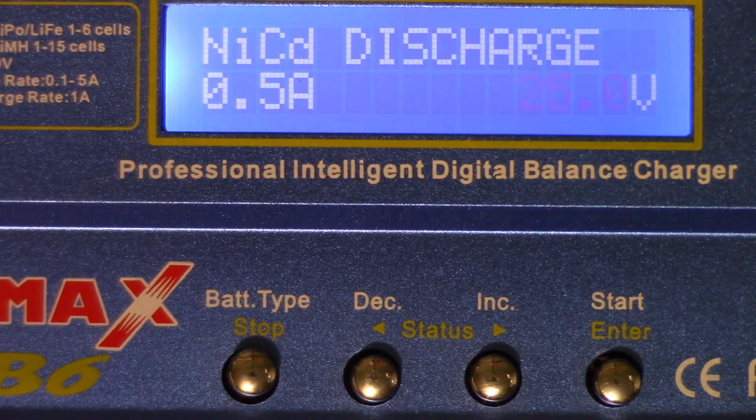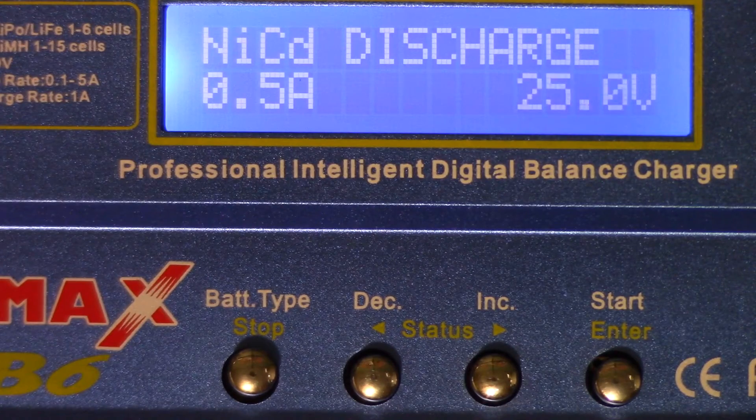I can't stress this carefully enough: make sure you follow the specified discharge and charge levels for whatever battery you're using. You can find those on the manufacturer's web pages. If you're not certain, use the pre-programmed modes in the charger — like LiFe, LiPo, NiCd — for the correct levels for the standard battery you're using. That's my video on how to set the discharge modes and custom voltage levels on the iMax B6 LiPo balance charger. Thank you very much for watching — if this helped you, click the like button and subscribe to the Richard Lloyd USA channel.